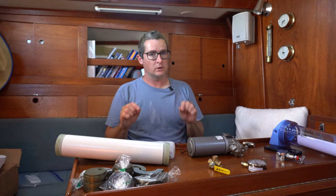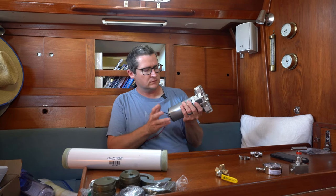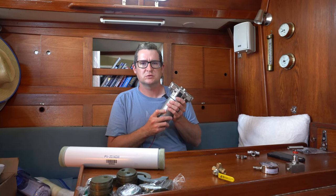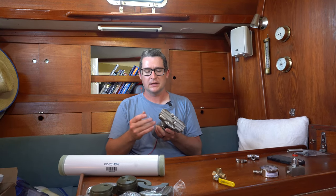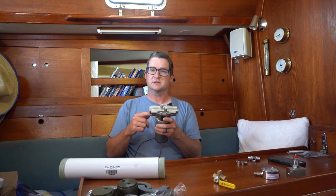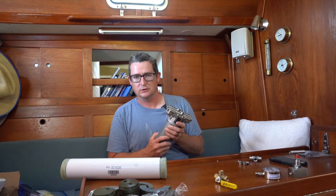Let's go over the major components we're going to use. This pump is made by PumpTech, originally designed for high-pressure spraying applications like pesticides. It's 12 volts, draws about 14 amps, has a pressure rating of about 1,000 PSI, and at that pressure it flows around 12 gallons per hour. Because it was designed for chemical sprayer applications it's impervious to seawater — stainless steel body, ceramic pistons, and a stainless steel piston pump mechanism inside with a cam that pushes on the two pistons. Now that people have been buying these for water makers, PumpTech actually lists desalination on their website as an application.